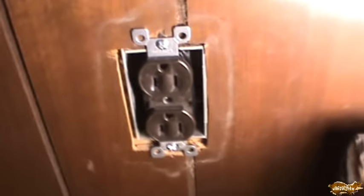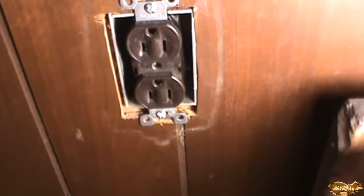I'm sorry, I didn't get any footage — I should have, but I simply got into the project and forgot to film. I successfully pigtailed the hot and neutral wires. I did not have a lot of room to work with — after I cut things down I did not have a lot of wire to deal with. But I got it pigtailed and hooked to the wire nuts in there. Wire nuts are on tight, and I always go over them with electrical tape just to make sure they stay tight — just that extra layer of safety.